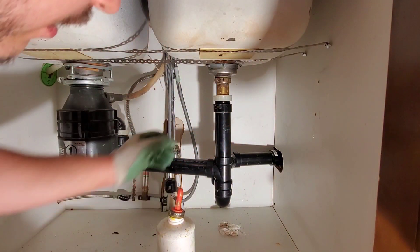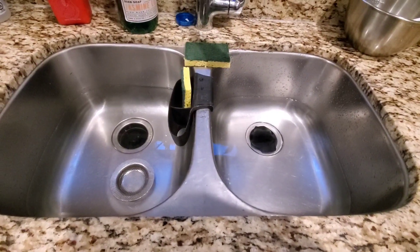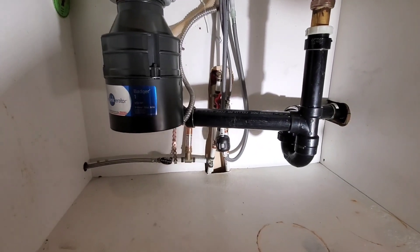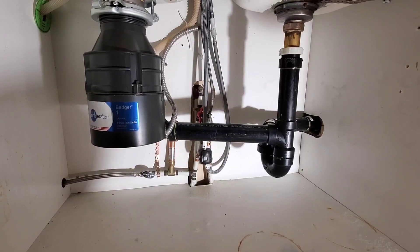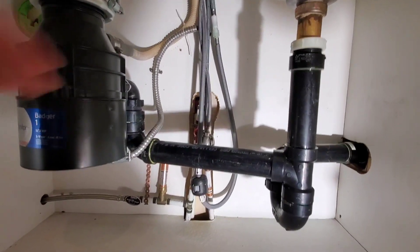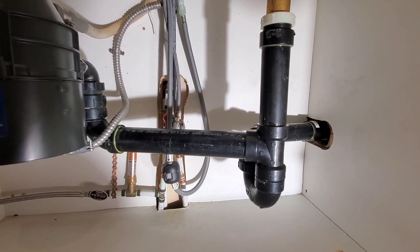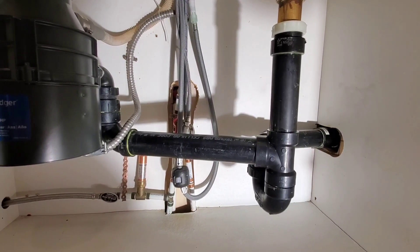Alright, so with the trap on, tighten up the nut and tighten this up. I will fill up the sink and then we're going to test for leaks. We're going to pop both sides and have a good volume of water go down. So what we're testing for is this slip adapter here, this slip adapter here, and the union trap — make sure everything is good to go. Guys, put about half a volume of water in each compartment, do a good solid test, do a couple of them, so you know when you're all done and ready to leave that you're not going to have any issues.